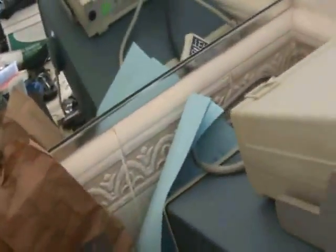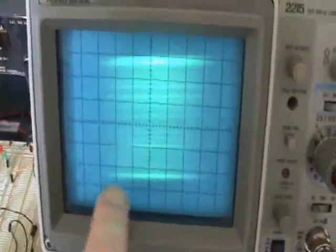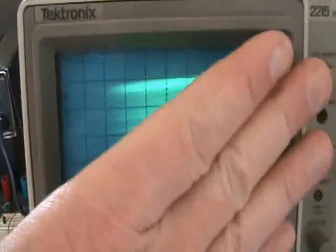The scope is in 1X mode at two millivolts per division — a really small amount of energy being picked up from this four-loop thing. Now if I unclip the 10 microfarad capacitor in parallel with it, you'll notice X goes way up. We're now at five millivolts per division — so about thirty millivolts — by removing that capacitor in parallel. But the Y direction didn't change very much. Also, the angle has slanted slightly, implying a slight phase difference between X and Y.